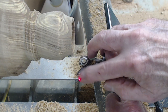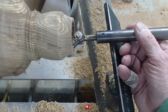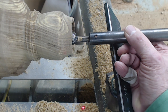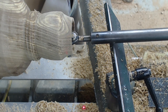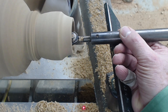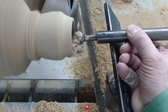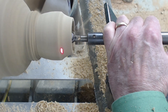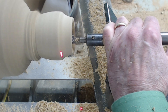I've got to fix it while I'm going and not settle. Let's say I have a tool mark — a bumpity-bumpity tool mark. I'm going to do it with the lathe off: I'm going to feel this surface back and forth, feel a little bump in there, and it gives me a little muscle memory. Now I'm going to turn the lathe on and sweep across there listening for that little hiss to clean up the tool marks.